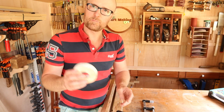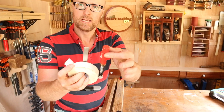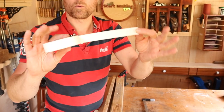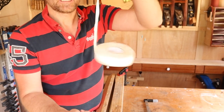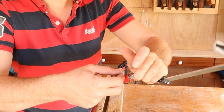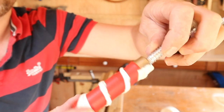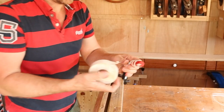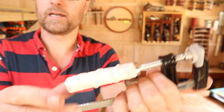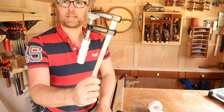This tip I can attribute to someone. I've been watching Rob Cosman a lot as I've been learning — the guy is a craftsman. If you look at his tools, you'll notice he has adjusted the handles. These wooden handles don't give you a good grip. This is ice hockey stick tape — it's fantastic. What he does is take it and twist it so that you get a cord. Then stick the top to the top of your handle and wrap the cord around it until you get to the bottom. It doesn't matter how neat you are, but what it gives you is a raised cord all the way down. Then you just wrap the tape around the handle. Give it a grab — it's got a really tactile feel. And there you go — you've re-gripped your F clamp. So between the grooves, the grip, and the glue, that F clamp is now good to go.